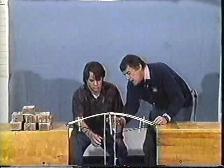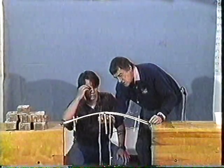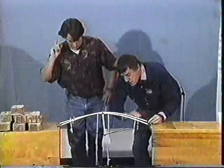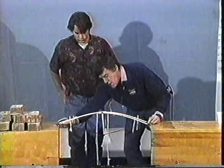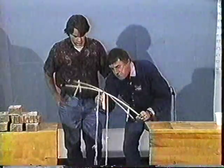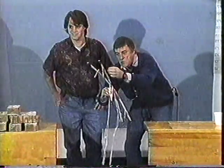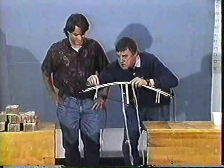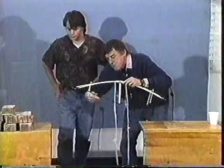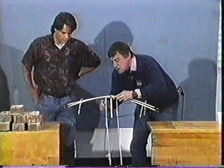One has, again, an effective depth in the middle — it's very deep — with this long member, which is actually doubled, as you can see. They're pre-stressed; these members are arched, not because they've been steamed that way, but because this heavy bunch of cords at the bottom here — that's what these are. These are not supports; these are totally independent. They're just things used to wind up and get some pre-tension in those tensile members, and then just resting against there.